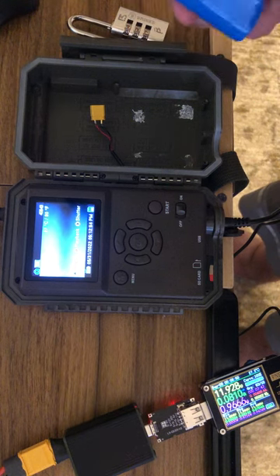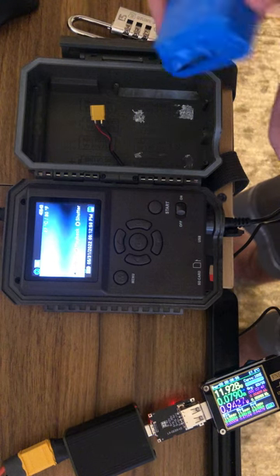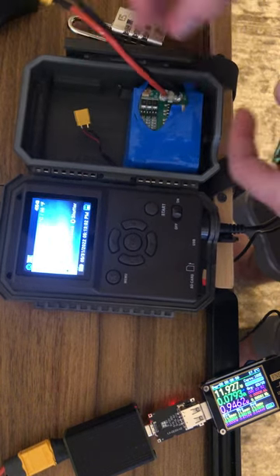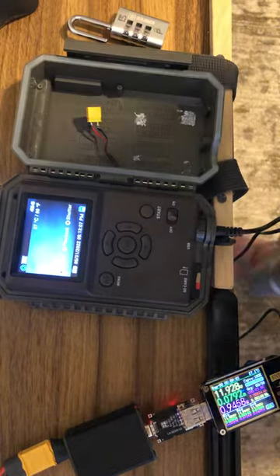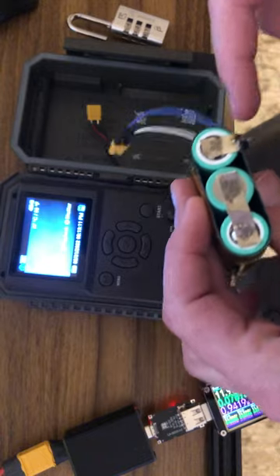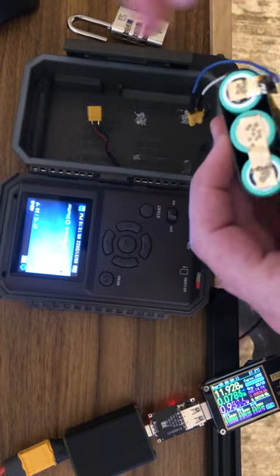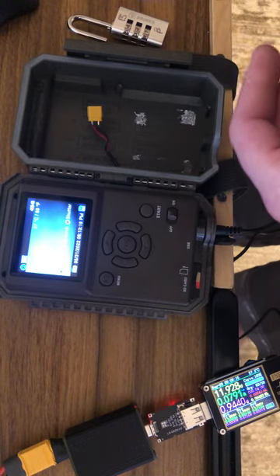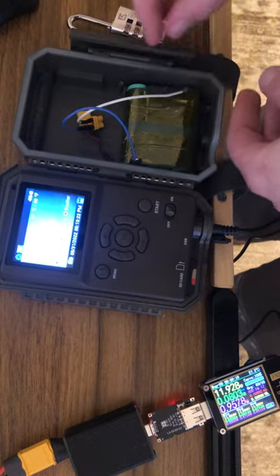This pack isn't the one I'm using — it's actually for a drill because these are high discharge cells. But it is shrink-wrapped and fits down there like a glove. Here's the pack I am using: these are 10-amp cells, still relatively good discharge, and they're 3200–3300 milliamp hours. They're EVE 33V cells, so I still need to shrink-wrap this.